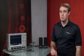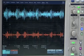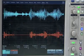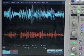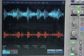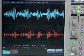One really cool new feature called Audio to Haptics takes audio from music, a movie, or a game and automatically converts it to haptics. To demonstrate, plug in the audio source to the audio jack on the DRV2605 EVM and select mode 0. Then press button B1 or B2 and feel how the actuator vibrates in sync with the audio. You can see on the oscilloscope capture here, the output in orange matches the audio in blue.